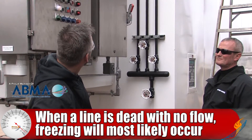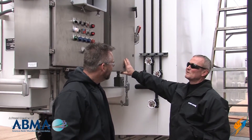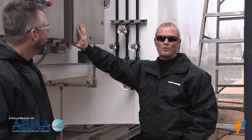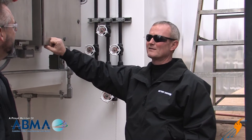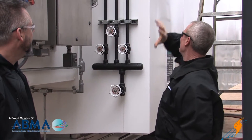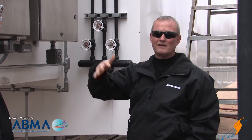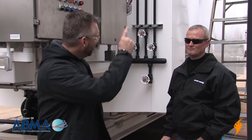Let's talk about the front of the burner and shelter. These are all watertight, so we don't have to worry about water getting in them, but here's what we tell customers: yes, this is designed to operate outside and it'll run in a rain storm, but if this boiler fails and your electrician has to get into that panel when it's raining, he's not going to open that panel up. So at the very minimum, put a rain shelter over the front of this burner to keep the rain off. If it's going to be there for a long time, go ahead and put a complete enclosure over top of it, seal it all the way to the boiler, put heaters in there — then you don't have to heat trace and insulate anything, and when the operator's out here working on it, he's in a comfortable setting rather than out there at 10 below zero with wind and snow. I remember in New York they put those shelters on — makes a big difference.